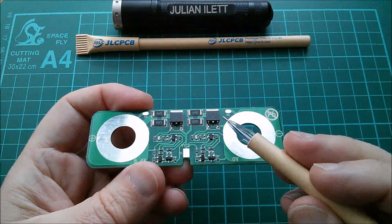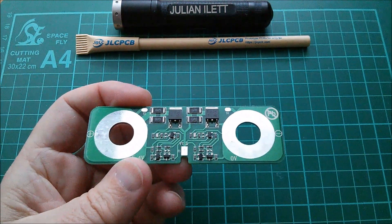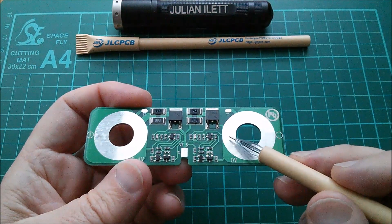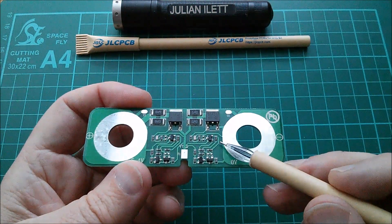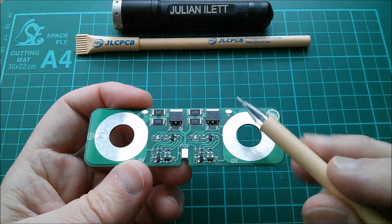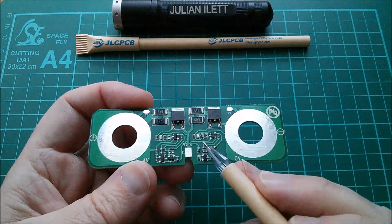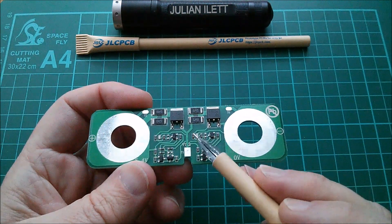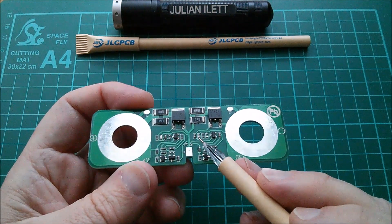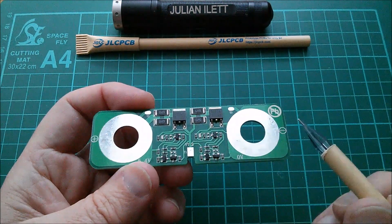Let's quickly check that D1804. It's not a MOSFET — it's a 2SD1804 bipolar transistor. We've got collector-emitter 50 volts, collector-base 60 volts, collector current 8 amps, collector dissipation 20 watts. So it's a high-power bipolar transistor. There's also an LED here — they've actually integrated an LED onto this one, one per channel.